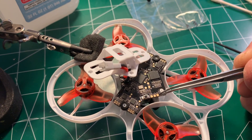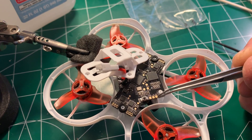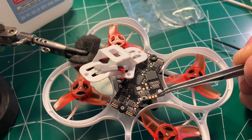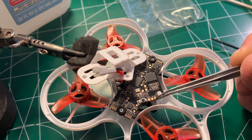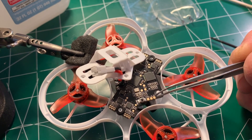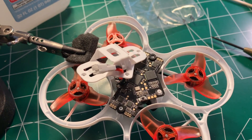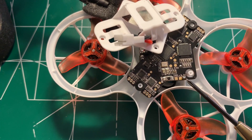You want to tin up only one side and not the other. You don't want to tin both pads, because if you do, when you try to solder one end of the surface mount capacitor, the other side being pre-tinned will cause it to sit cockeyed. So tin one pad first, then place the surface mount cap on the tinned pad. As you can see, I tinned the 3.3 volt side to start with.